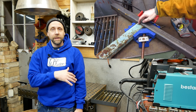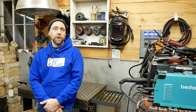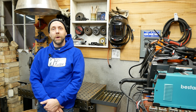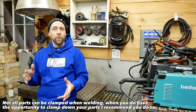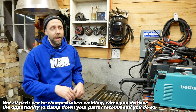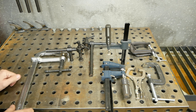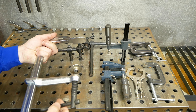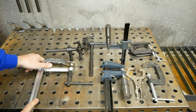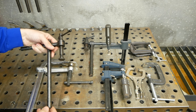So clamping your work well to either a welding table or even jigging it to some other type of box tubing — anything you can clamp something to — to lock it down and keep it held really well before you start welding it will make a world of difference. There's a wide range of clamps available. These ones are really nice for clamping on large stuff — you can really get a lot of clamping pressure with them. Depending on manufacture and make, these tend to go from about $20 to $60 a clamp. These others sell from anywhere from $20 to $50.